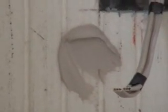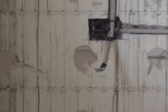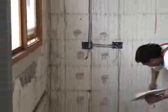And as you can see, it's across the centre of 2 of the dovetails, so what will happen is as it squashes out like a pancake, it'll mechanically lock into the actual dovetail grooves when it's dried, adhering the actual sheet mechanically, not relying on adhesion.